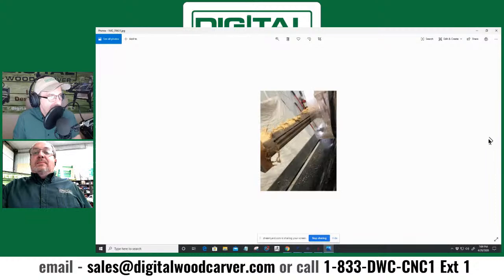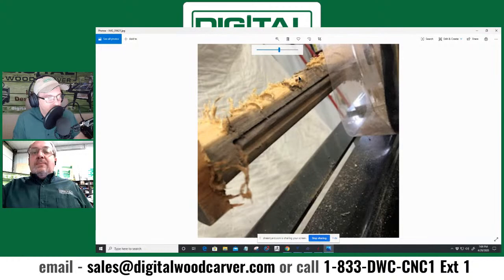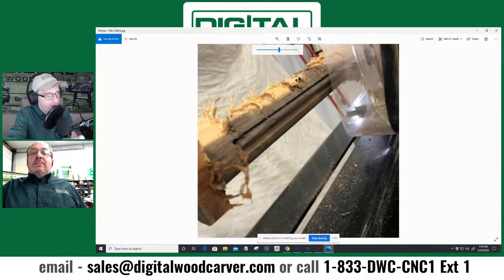And here is now the beginning stages of the finishing, where that ball nose bit is just starting to wrap itself around. And it's wrapping around, if you were standing behind the CNC looking at the motor, in a counterclockwise motion. So that bit is just coming around, clearing out this bead here, and then starting to work towards that main area.